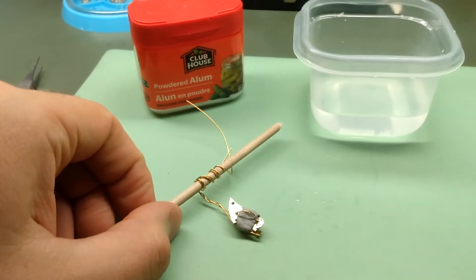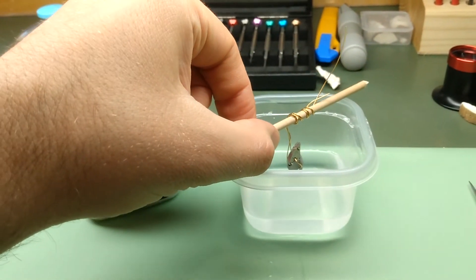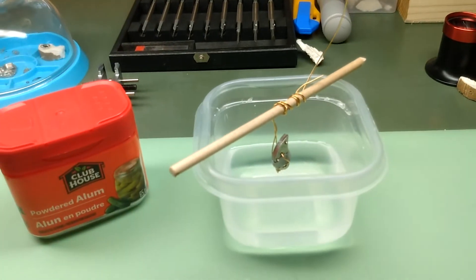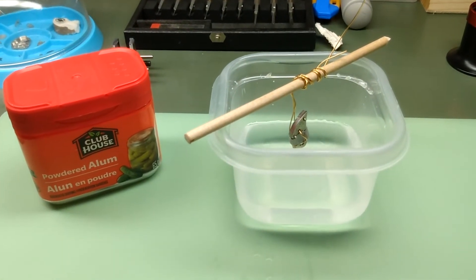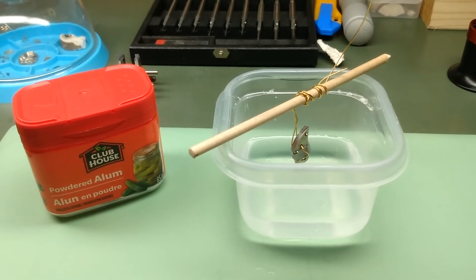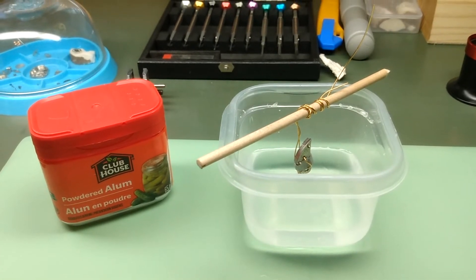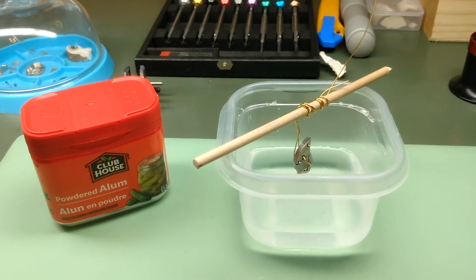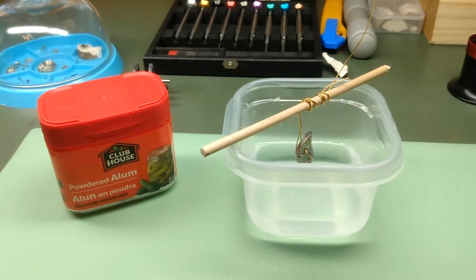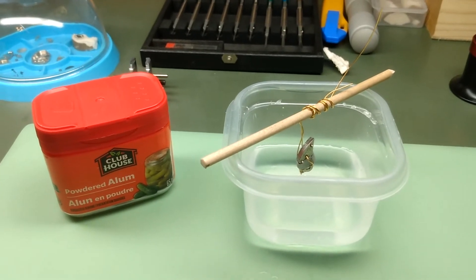What I did was put just a little bit of brass wire through the cock, and suspended it with just the stud screw hole — the very tip of the balance cock — in the liquid. I've kept it in the ultrasonic tank and run that for about 10 to 15 minutes at a time for the past two days. Now it's time to show you my progress and how effective this method is.